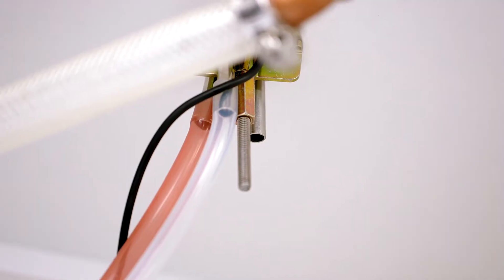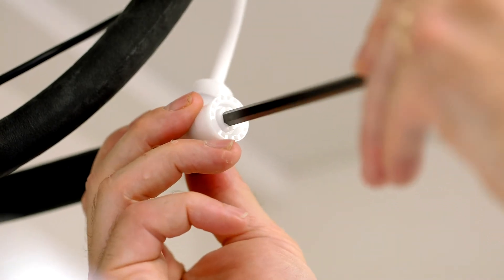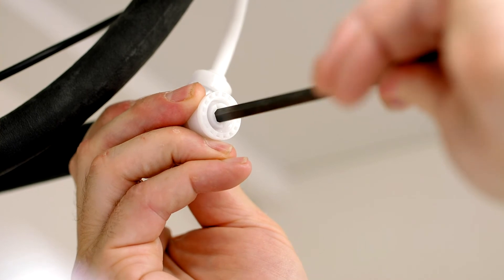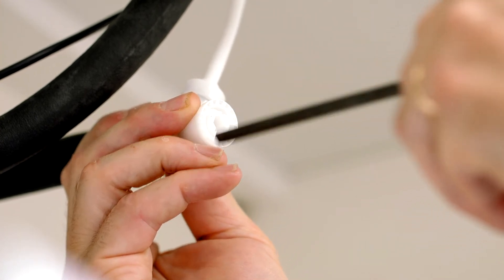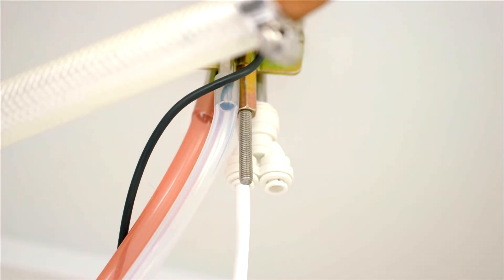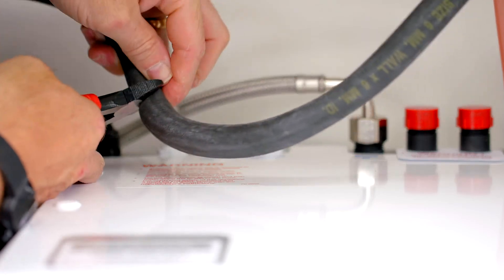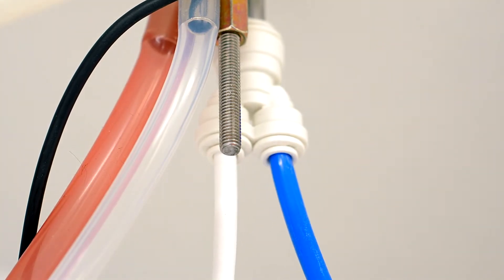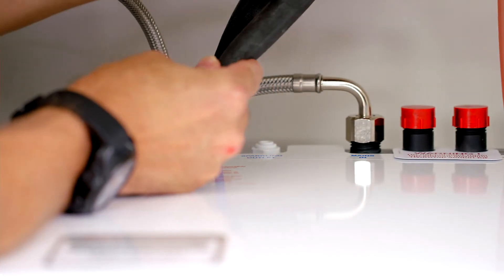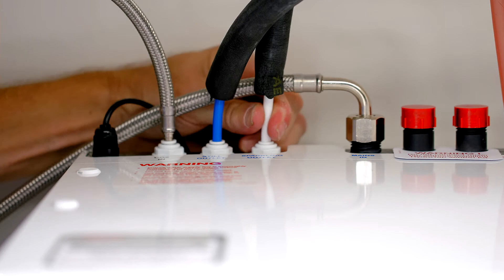Next, fit the supplied Y connector to the spare pipe on the bottom of the tap. The carbonation valve is used to adjust the flow of sparkling water from the tap. This adjustment needs to be made with either an Allen key or a flat blade screwdriver, and needs to be made after the commissioning stage of the G5 HydroTap. Fit the carbonation valve to the bottom of the Y piece. Then mark up the chilled and sparkling hoses. Use the blue John Guest hose to connect the chilled water out to the Y piece, and use the white John Guest hose to connect the carbonation valve to the sparkling out. Remember that the carbonation valve will need to be adjusted later in the process.